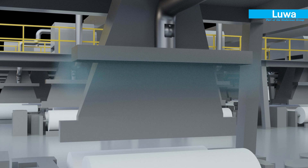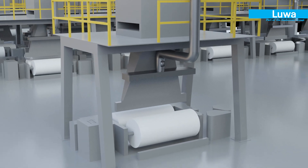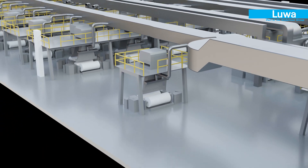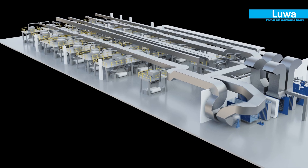The saturated air is distributed evenly across the width of the loom for maximum moisture gain, thus reducing yarn breaks and improving loom efficiency. Each loom in the shed always gets the correct uniform conditions, ensuring maximum efficiency at all times.